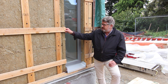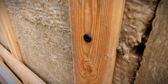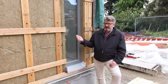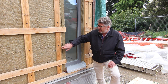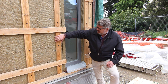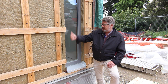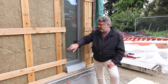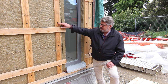We've got our nailers here which go right over the face with these strut-like fasten-all fasteners. These are rigid fasteners that penetrate through the sheathing and then go into the framing a minimum of an inch and a half. They form a rigid strut every two feet on center that secures this batten to the building with very little deflection up and down, carrying the vertical load of the siding back into the frame of the building. That whole job is done by these black fasteners right here.